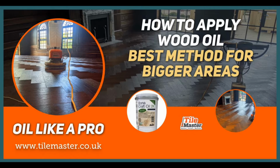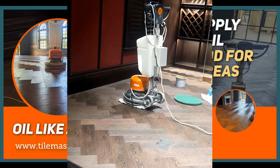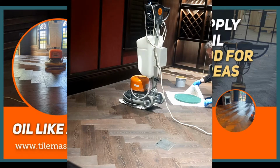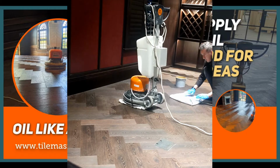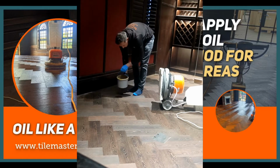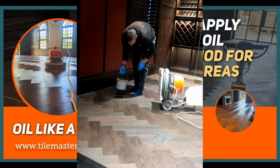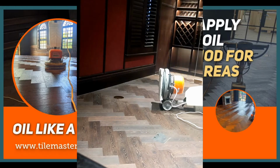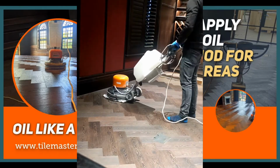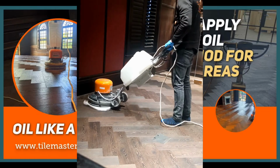So the best method to apply the oil is using the buffing method. What we want to do is, using the rotary machine, apply a white pad with an oiling cloth attached to it, and then apply a small amount of the oil to the floor. We'll just pour about 25 ml on, and then work that into the floor and work it around, and that buffs it into the floor.